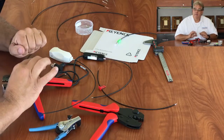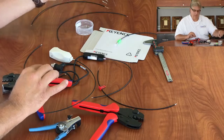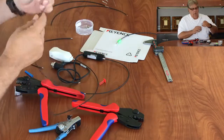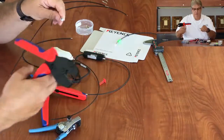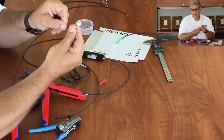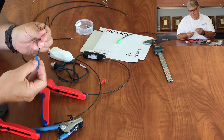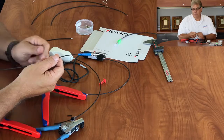In the connectors in the Light Seal versions, we have the LC, the SC, SMA, STA, and we also have a VersaLink model. On the ST, I'll demonstrate one of these for you. Using the same 1mm cable, we can strip back the jacket, insert an ST connector on there, and swage the nose of the connector. So now that connector is held very tightly while just swaging that nose. Then we can come back and crimp the back on, slide the strain relief on, and now you have a ready to use ST connector that's field installable.